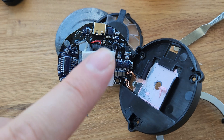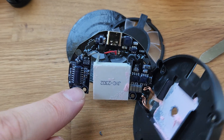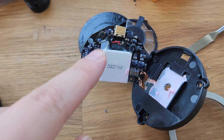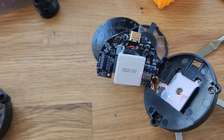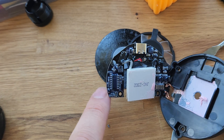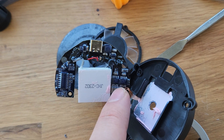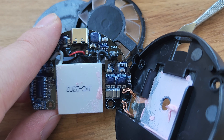This 16-pin IC and these two 8-pin ICs have no markings visible through this very thick and firm conformal coating. Googling similar devices shows that this IC actually never has a marking or no name — it's just some generic 15-watt WPC/Qi/MagSafe charger. These over here are just MOSFETs — you can tell by their very beefy output legs.